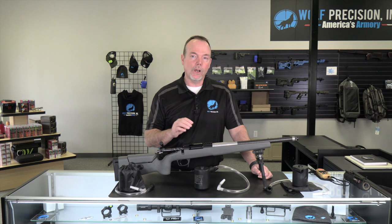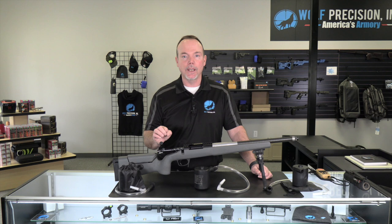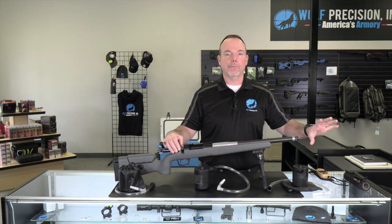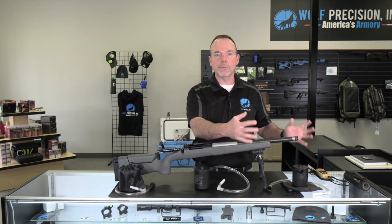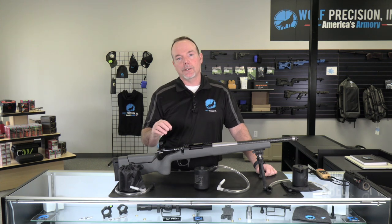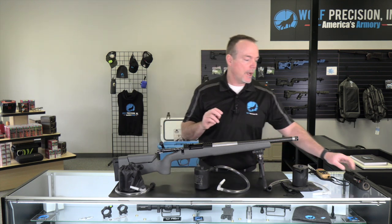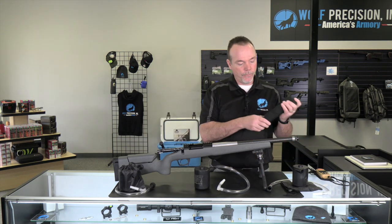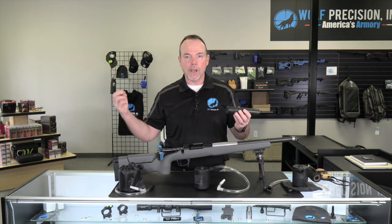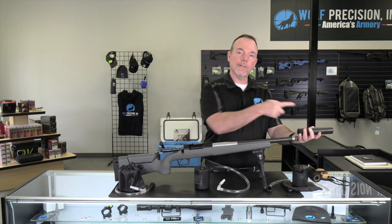And so we have to not just get air through, but we have to get a massive volume of air through. It's not just about having a little nozzle with a little high pressure, because once you start running it down the barrel and in the suppressor, you lose all that air. At this point, it's about volume, not speed, right? So the other issue that runs into this as well is we have to get the suppressor to cool down as fast as possible. So we're trying to take, in essence, this big baffled tube, which holds a lot of volume of air and heat, right? We've got to get a ton of air through that suppressor, forcing the heat this way rather than letting it sink back.